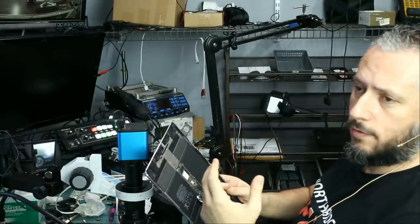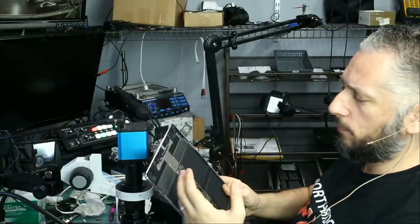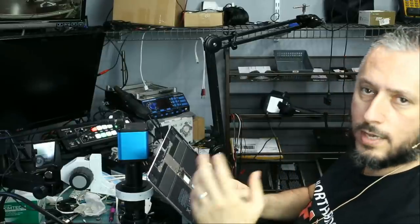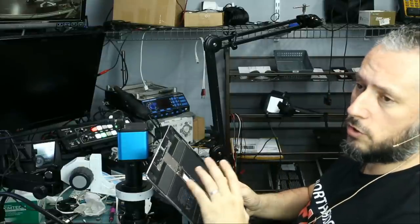How did I know that 0.47 amps is an indication that there's a short on the board? Experience. I've worked on those before and every time we have 0.47 to 0.48 amps draw from the amp meter it's almost always a short.